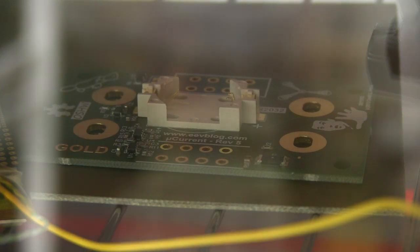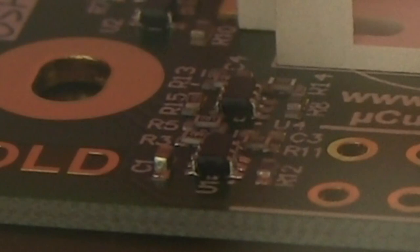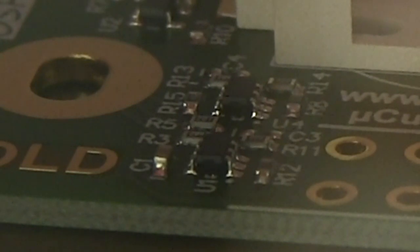The controller has just switched into the reflow phase, so the heater is full on now, and it should ramp up reasonably quickly. It should start to reflow around about that 220 C mark. It's about 178 and climbing at the moment. There we go, we've hit 220, and I think, is some of that paste reflowing?